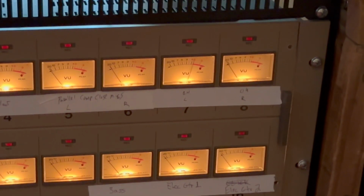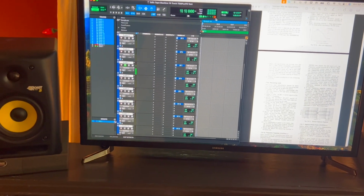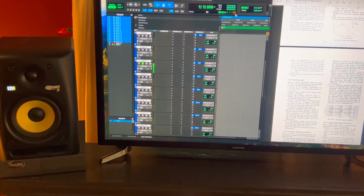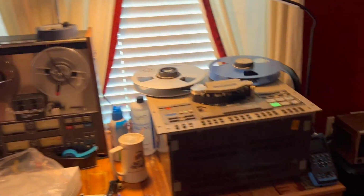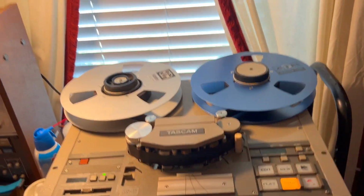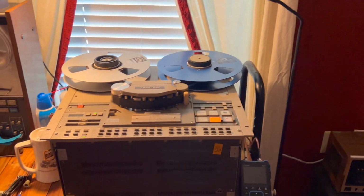That's about what it looked like when we were recording it. We're high above that noise floor, so we still get some tape hiss, of course, but we're going to get the most out of this brand of tape, recording at +6 over 185 or +3 over 250. That's it.